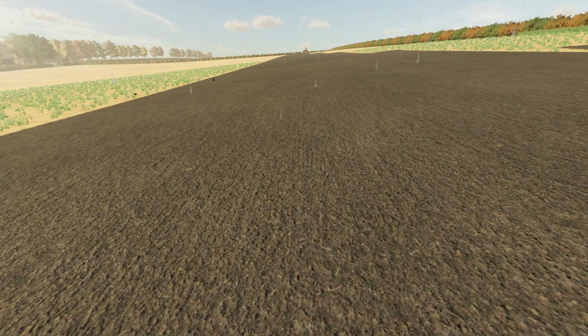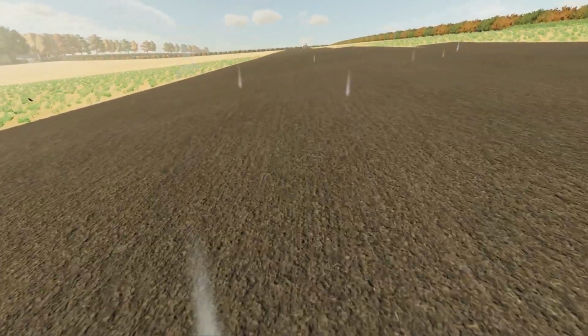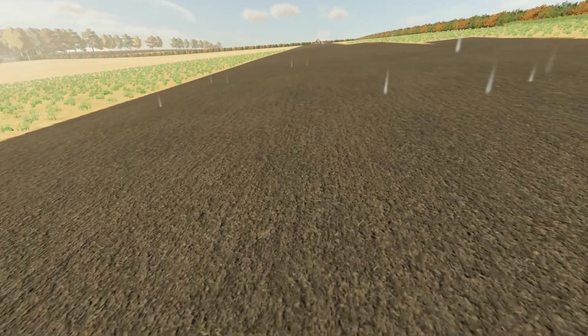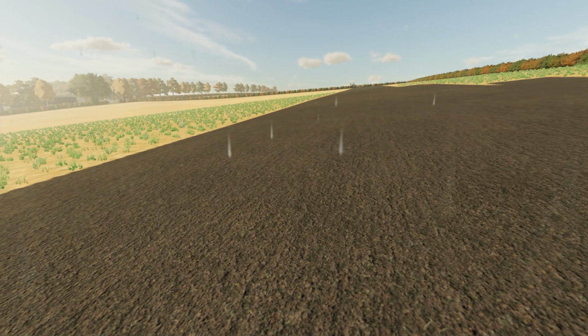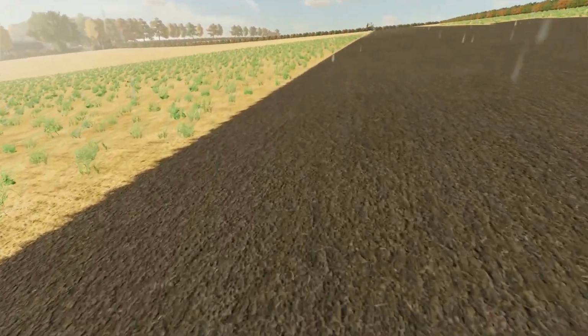But when it's soft, those shins still push the soil apart, so it still prises it open the same. But because the ground is soft, it's able to sort of fold back in on itself. So essentially it's closing back up the channel that you've already made, nearer the surface than underneath. But there's no point having a channel underneath if the surface is closed, because the water can't get in in the first place. So you need the top half of the channel to be open for it to have any effect.